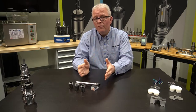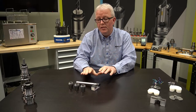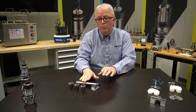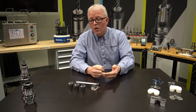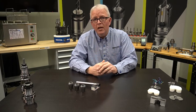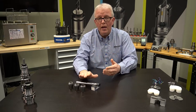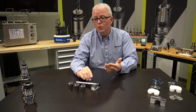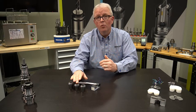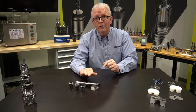We've covered what we offer in extensions in previous videos, so you know the accuracy of our tool holders. But what about the collets that can go into those tool holders? We offer our standard precision collet — that's a 10 micron runout on that collet. Option number two would be the UP collet, which is a 5 micron collet, so twice as accurate as the standard.